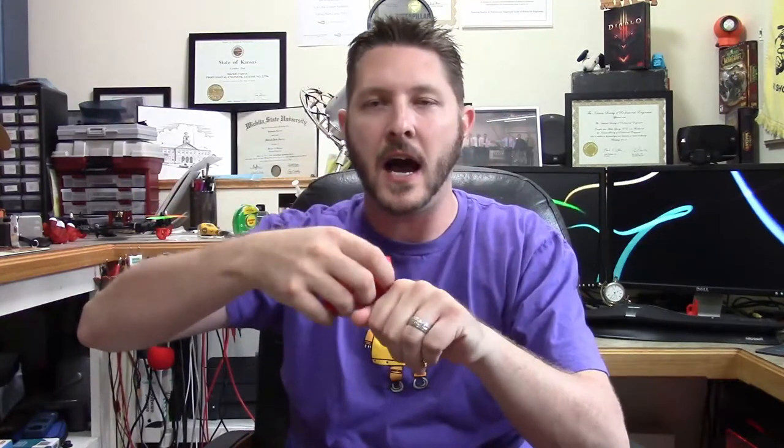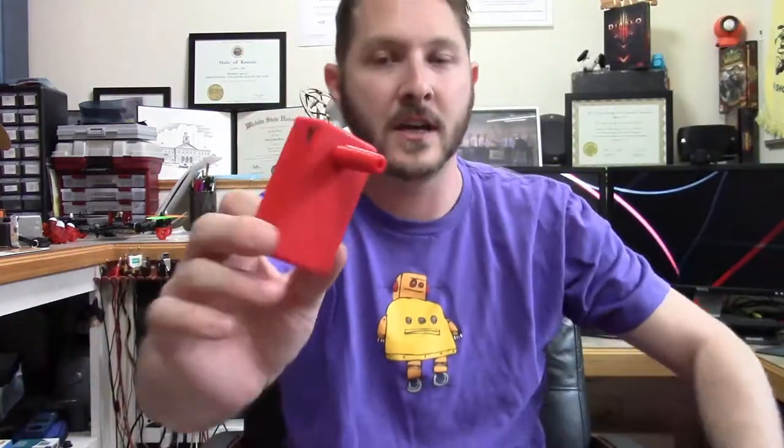I also made a slot for a switch so you can turn it on and off. The centerpiece just goes in and locks — you can hear it snap in. I'll probably put a little super glue around it. The hexagonal shape means when you're cranking it into the rubbery stopper, it won't just free-wheel and bust the glue joint. The cord comes through the center perfectly. This design will be available on Thingiverse, just like my RetroPie-on-the-go case.